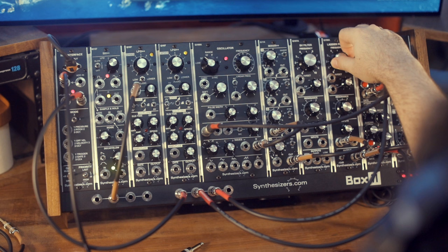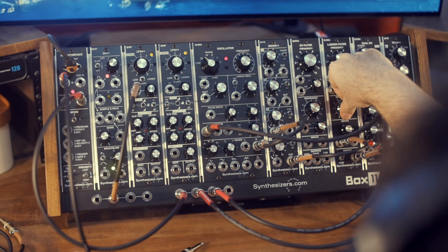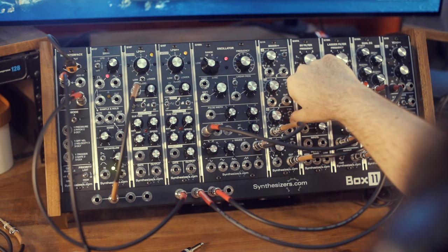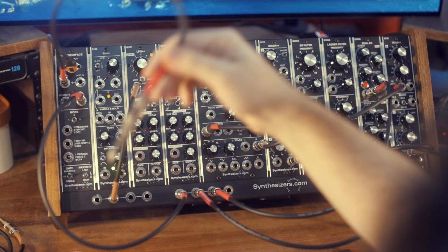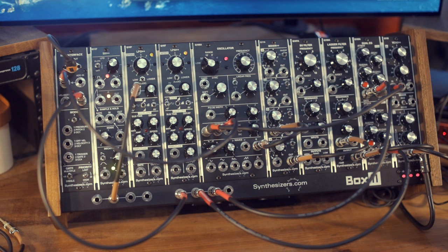The filter can be set very low, pretty bright, or more nasal. You can drive it with 2X or, if you're feeling indulgent, 100X. If you want to tune this kick, all you have to do is take the pitch — which we haven't been using — and put it in the other available input of the one-volt-per-octave. At that point you can play it like a keyboard.